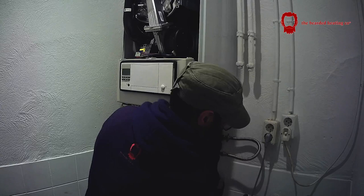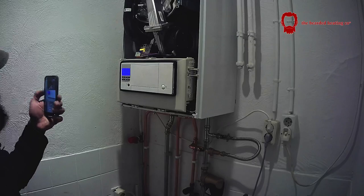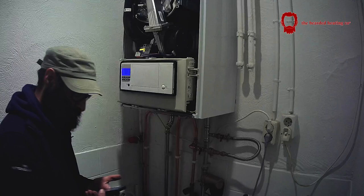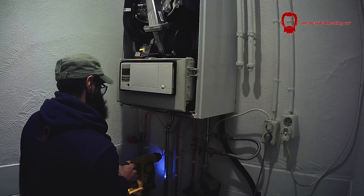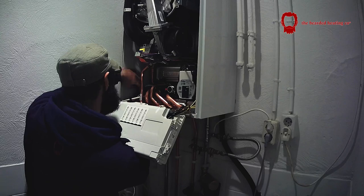The Ecotech Classic here doesn't come with a PRV built inside it, so I fitted the PRV on the flow pipe going to the expansion vessel. The system is back on and I'm doing my ritual of firing the boiler for the first time live on Instagram for the Vaillant family. That's all done — now I'm just wiring up the BDR91 for the Evo Home system. Configuring the BDR91 with the Evo Home system isn't in this video, but I did that as well at the end of the job.